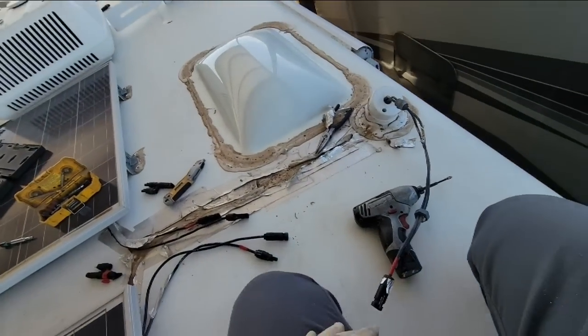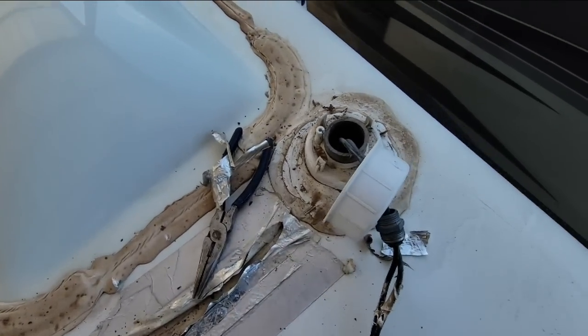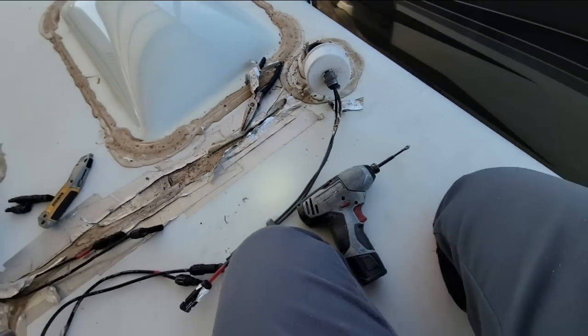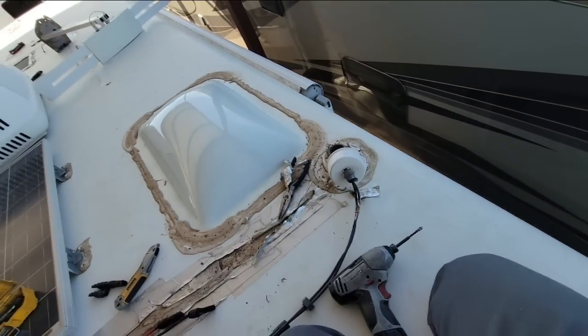All right, well, I've never seen solar installation through the vent pipe of a sewer tank. And the wires are actually coming up to the vent pipe, so that means I have a lot more extra work to do here that I didn't plan on doing, because I'm not going to leave it like that. How did somebody do that? It means they drilled a hole through the stack somewhere to feed the wires up through. So I'm going to have to fix the stack too.